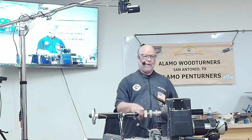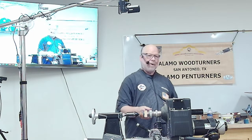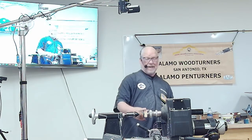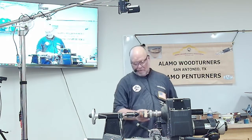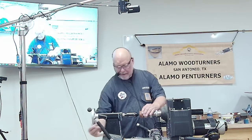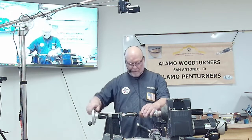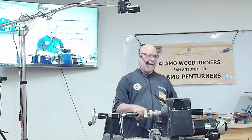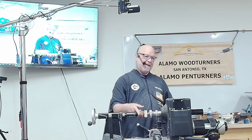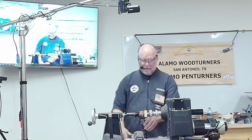Now this will all be trued up and rounded, and even if this line is not perfect, it only looks not perfect when it's spinning on a lathe. And actually an angle would probably be cool in some ways if it was really acute, but what I've done is I'm going to use this to hold it in because the glue joint of CA is not the best, so it's not going anywhere like that. I'll round it, shape it, and then take this off only when I'm addressing that very bit, that front. I've had it fall apart on me, so buyer be warned.